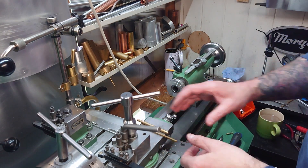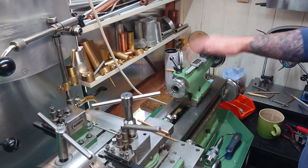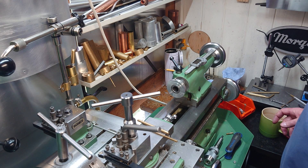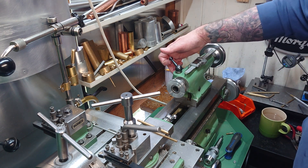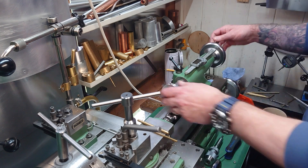How do folks, Bones here. Just going to show you a quick modification that I've done to my tailstock of my Super 7. One that's been bugging me for a while - a little problem like this has had, and that is that there's a bit of play in the barrel here and the pin that engages with the slot in the side of the barrel.